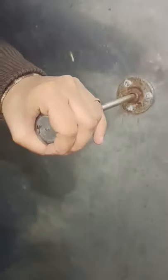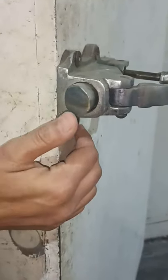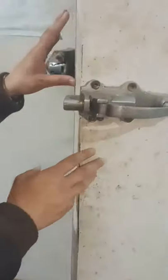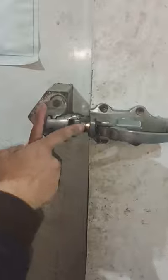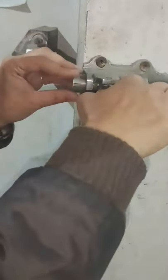Now coming to the door side. This is the handle of the door which can be operated from inside to open or close the door. For closing, it is pulled until the door closure latches onto the roller. To open the door from inside, we push this lever so that the locking pin retracts and releases the roller, then we pull the door out. From the outside, we force the door so the locking pin engages behind the roller, and to open we pull the handle so the roller pin retracts.